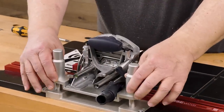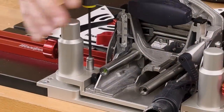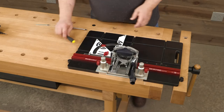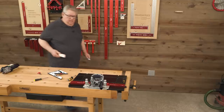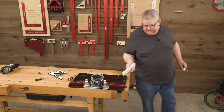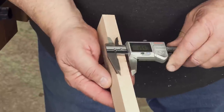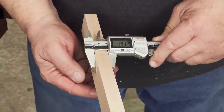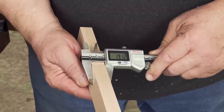Now we'll drop that on the columns in the base, clamp it up, and reinstall the safety stop. I have some material here — let's take a look and see what we have for thickness. We're going to check this in millimeters. It's just a little over 19 millimeters, and we want the mortise relatively close to the center of that.